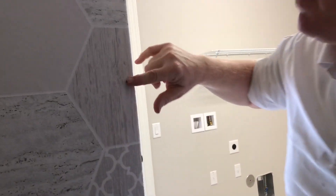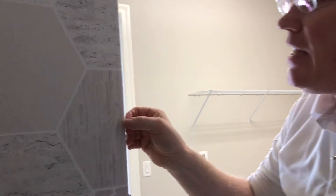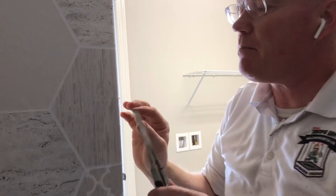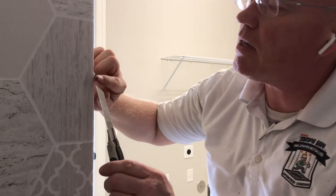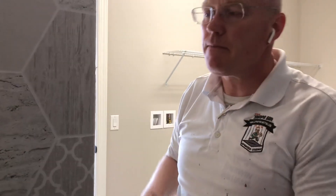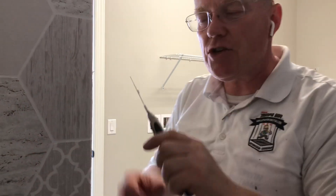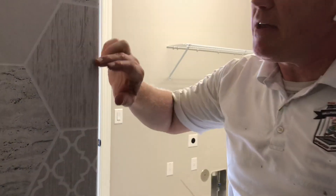You can see how now it looks perfect here. But there's one piece in the whole cut that's going to give you a problem. As I mentioned in a previous video, you don't trim this until it's hard — let this dry. When it's dry, you just take a six-inch taping knife, put it on this side, and cut up against it. Then it's perfectly sharp. You can't do it while it's wet — it's like cutting a marshmallow; not going to happen.